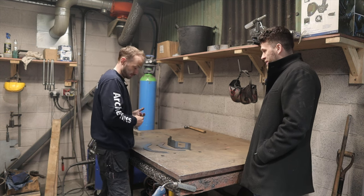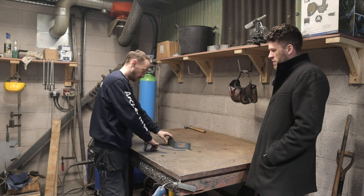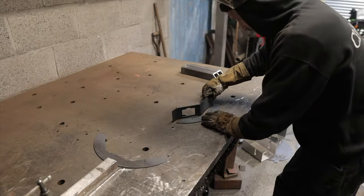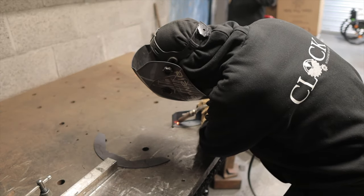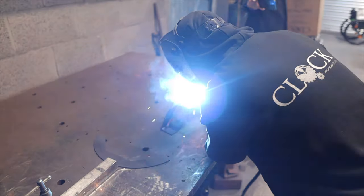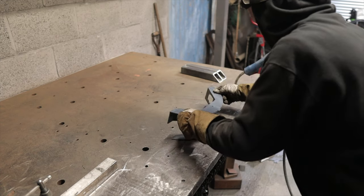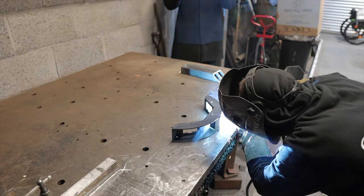So the process — I fabricate and manufacture the stoves down here. We start with various bits of metal. The first thing I'll do is jig this together; there are little locating tabs. What part of the stove is this? This goes on the inside of the stove, and there will be two parts that run off the back and run through the stove. These are air channels, obviously allowing your air through, and this sits on the inside.